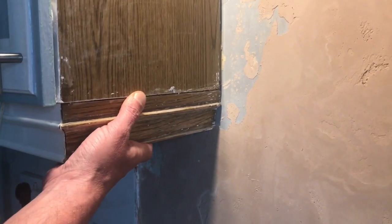You might find your plaster falls away, which is why I've re-plastered it roughly so it's just level for when the stainless steel splashback goes in. Also remove your skirts, which go here, and you'll see why when I start to lift it into position.